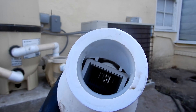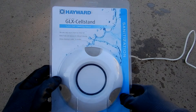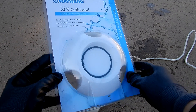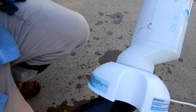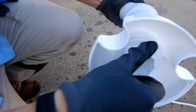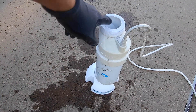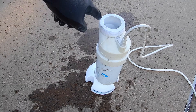I'm just going to give it a quick light acid wash with some muriatic acid. I'm going to use the Hayward GXL cell stand — this is a great tool to have handy for your PureLine salt cell. I'm going to thread the GXL stand into the PureLine cell and pour the acid in the top. The GXL cell stand will keep the acid inside the cell itself.